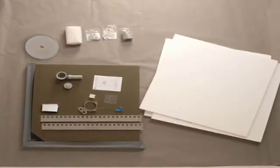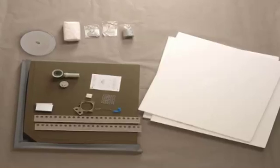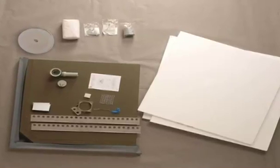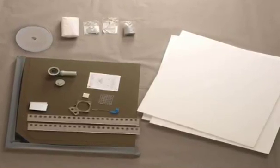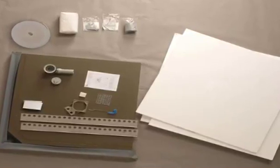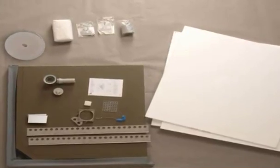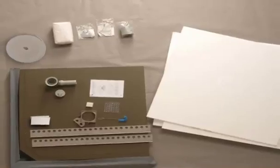In order to proceed with installation of the Olifilo Bilato shower tray, the following materials and tools will be required: spacers, trap, corner tile support, edge tile support, 7mm edge spacer, special sealing adhesive, sealing tape, edging strip, spirit level, and hacksaw.